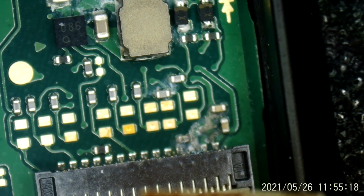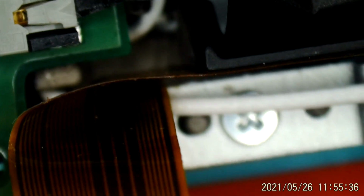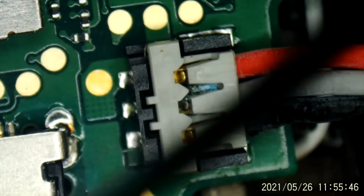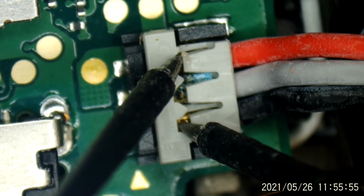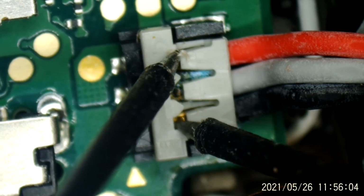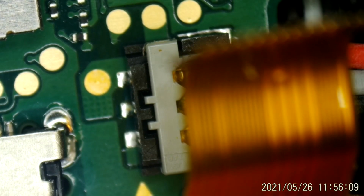Let's see. Speaking of battery, what was that battery voltage? I'm going to guess it's next to nothing. Let me get that in the shot. There it is. Ooh, a little corrosion down there too. You can see it, can't you? So if I go here and here, it actually says negative 0.015. Yeah, she's dead. She's gone. Okay. And of course, look at the rather obvious moisture sensor. So let's do some cleanup. Maybe put a little juice on that battery manually and see if she will come back to life.